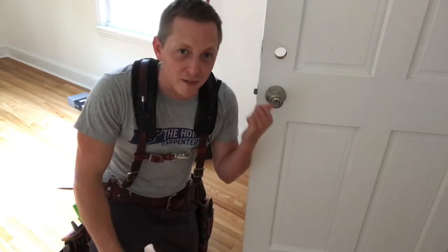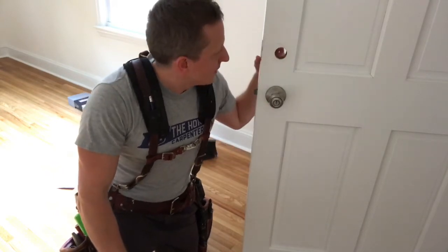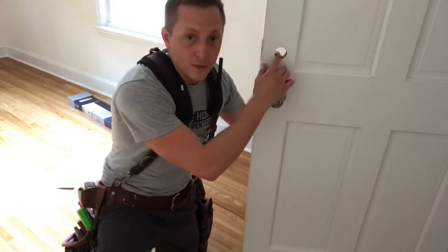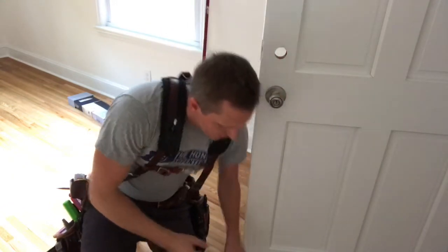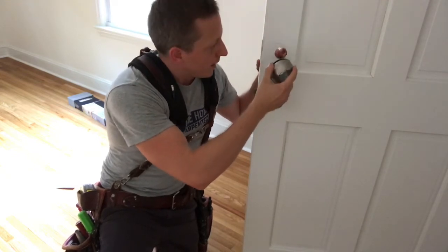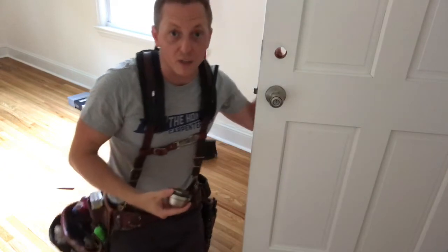Hi there, I'm Ethan James with thehonestcarpenter.com, and I've got an interesting problem on a job site today. Homeowner brought it up. They went to install a new deadbolt, and they found when they took the old one off that the pass-through hole was too small to accommodate the flange of the new deadbolt, which needs a 2 1/8-inch hole, and this one's only maybe about 1.25 inches.